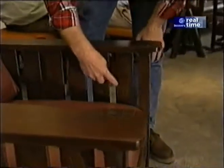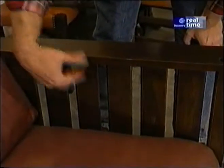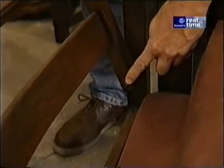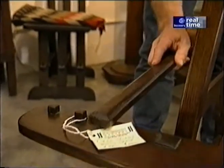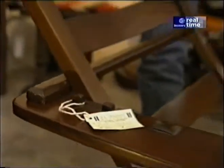This is their version of the Morris chair, which came out of the arts and crafts movement in England. It's a beautiful piece made out of white oak. It has this through tenon detail, a corbel to support the armrest, and the side is enclosed with thin slats mortised into the armrest and the rails. The back actually adjusts — it pivots on wooden pegs. The adjustment mechanism couldn't be simpler: no metal, just a piece of wood with a square mortise that fits over a peg for the full upright position, in between, and fully reclined.